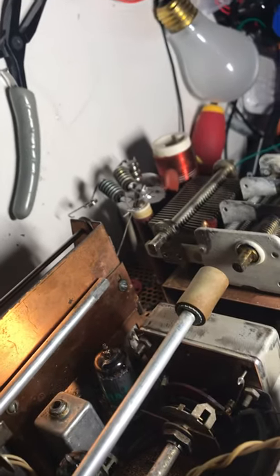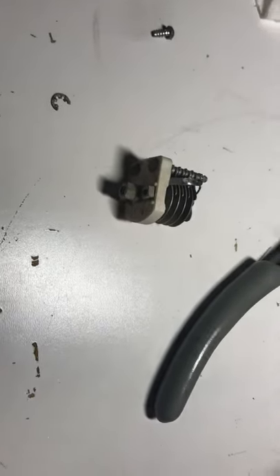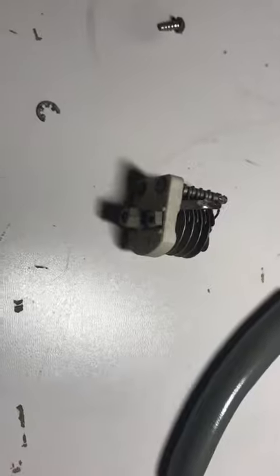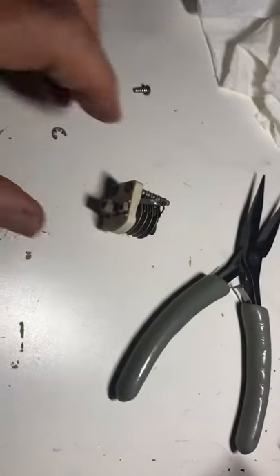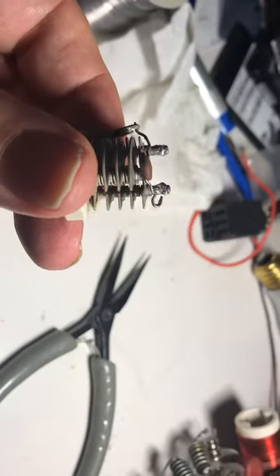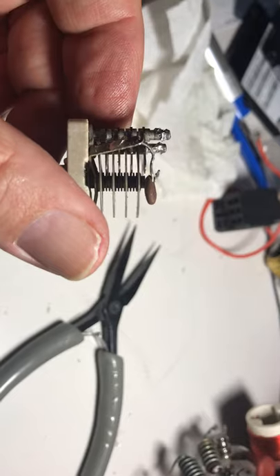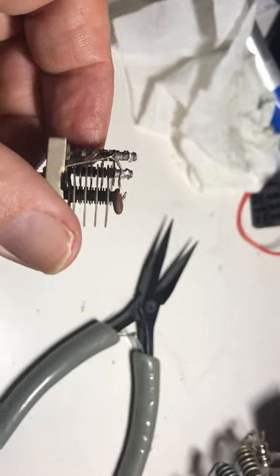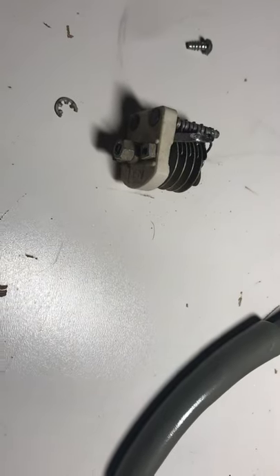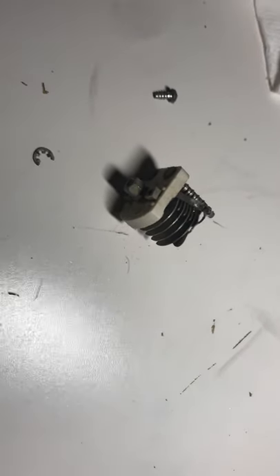This has been a sad and traumatic day trying to get anything done with this old transmitter I've been working on. I took this thing apart two weeks ago and cleaned it, and I'm not sure if I bent one of the fins on this thing. I think the fin on this variable capacitor was bent when I bought it. When I bought this rig from eBay, one of the first things it did was smoke out the B+ resistor on the 12BH7.